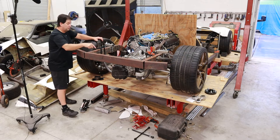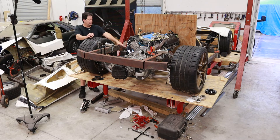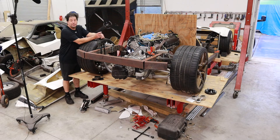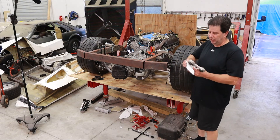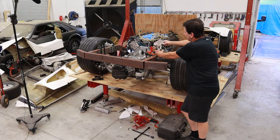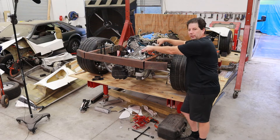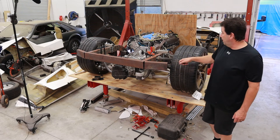I've got it all lined up. The transmission is bolted in and currently held with clamps — I've got to tap that and get those mounted. I've got to create the motor mount positions for the front; I'm waiting on the motor mounts since I used them for the back. Then I'll start hacking up the front end and get the other two inches I need for leg room. You'll notice these suspension points here — I'm going with a cantilevered suspension using push rods affecting a bell crank, with the shock most likely in this position. I've also got to put up the exhaust system; it'll run along the chassis rail rather than diagonal.